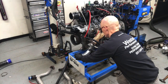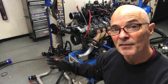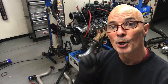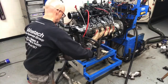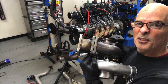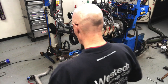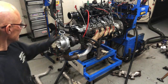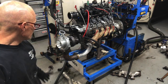We've installed our section of tubing onto our exhaust manifold and it looks like it's going to be oriented correctly. We're going to go ahead and mount the rest of it, mock it up, and see if it's going to be in the right position, then seam weld it permanently. As you can see, we have a T4 to T3 adapter flange because this is a small GT35. That looks like it is all going to fit. It is levered out there quite a bit, so obviously I would put a brace on it if we were running it somewhere, but for the dyno it should be fine.